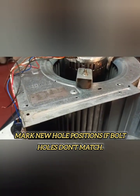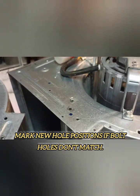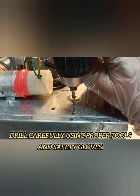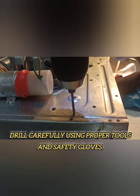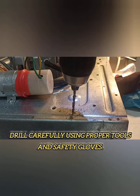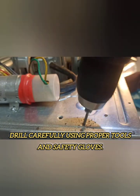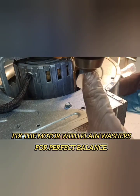The original 925 RPM motor was not available right now, and I needed to complete the job quickly. So I found an 880 RPM motor with the same shaft size, same body size, and same blower fitting. The only difference is a small RPM variation, but it doesn't make a big difference in performance. In fact, for most applications, 880 RPM works smoothly and gives stable airflow.